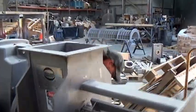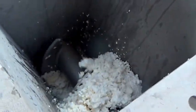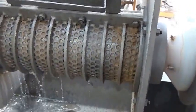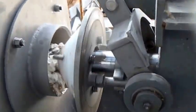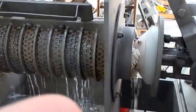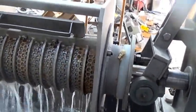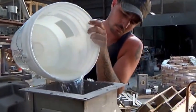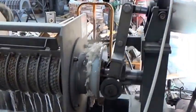Okay, we're feeding in the material going into the inlet hopper. We'll see what happens — let's see if it stays this way. The material's pushing out. Nothing comes out of this press unless something's going in to push it out. We've got the polymer all ready — full-inch screen dewatering. I just ran in the cone there. Pouring in the first pail. Must be feeding pretty well. We couldn't have poured a pail like that.